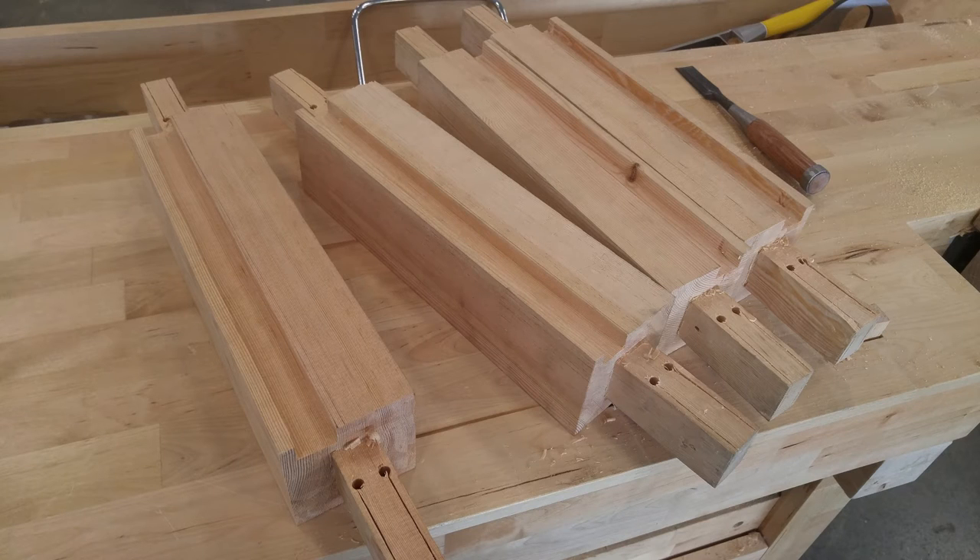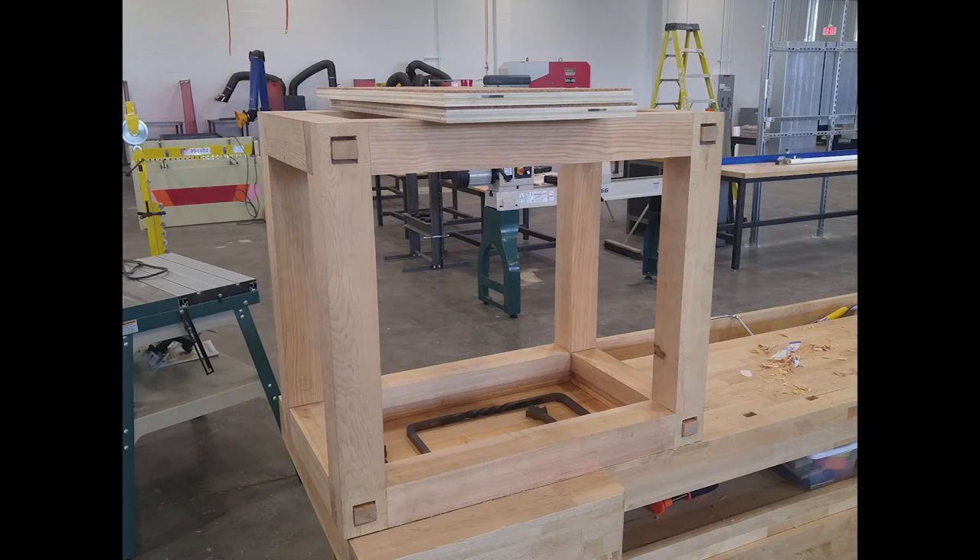The cross pieces also have grooves cut in for the shelves. I cut two relief cuts and drilled holes so that the splits wouldn't continue down the grain. This way I could wedge some walnut wedges in to spread out the dovetail tenon joint. Here you can see the cart dry-fit together, and you can see those gaps on either side of the tenons on the top and the bottom — that's where the wedges are going to go.